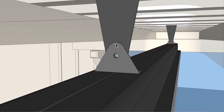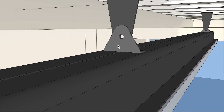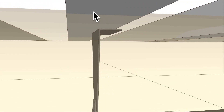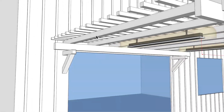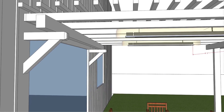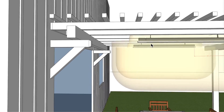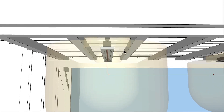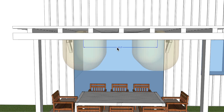The other thing I should mention about the slimline units is you can see this groove right here along the top of the unit. It allows you to move this bracket from left to right so that you can meet up with the joist you'd like to attach it to. We want to make sure we meet those clearances. Looking at this portion, we want to make sure we're meeting the below clearance of 18 inches — from the bottom edge of the heater out to the left, we're at 18 inches, no problem. And then 36 inches down below. That's 18 inches on all four sides for the lower section, and 6 inches on all four sides and the top for the upper clearance.